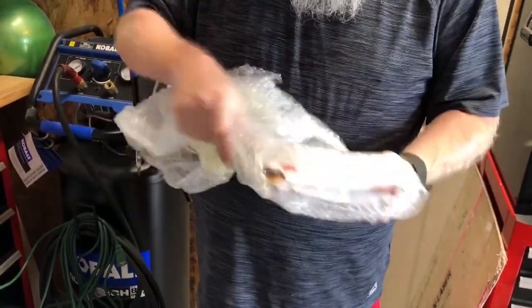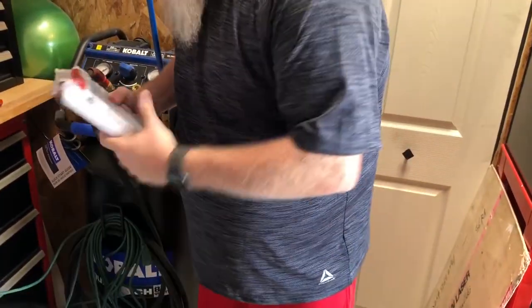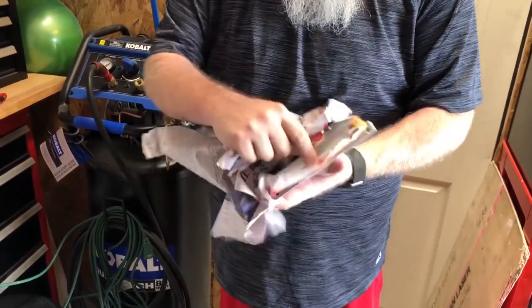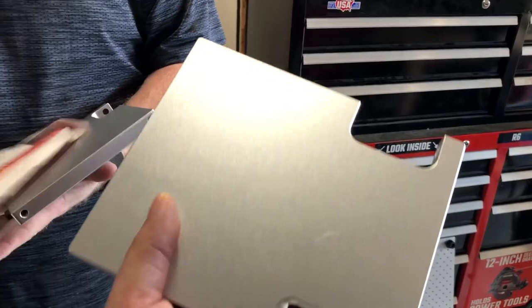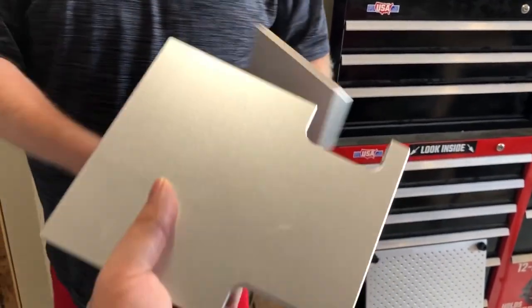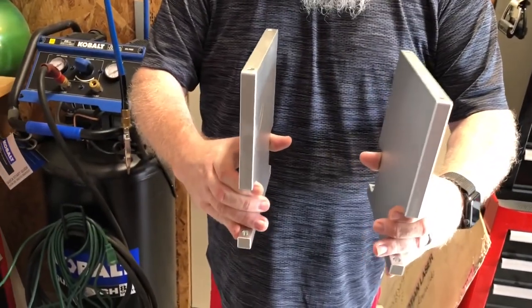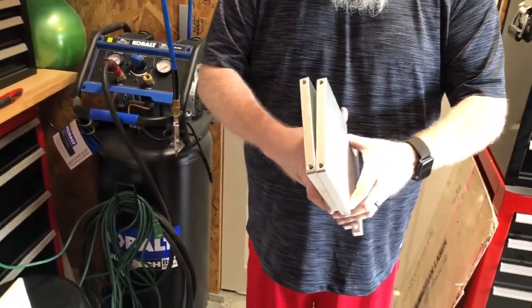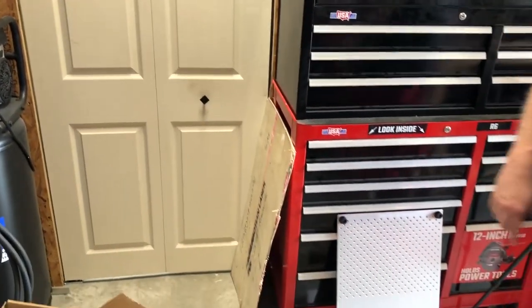It's the thing to lift the laser off the board - it's a chunk of aluminum. If you want to do a 300mm lens instead of buying a whole new gantry to set the laser on top of, you put this here and connect the laser to it - it's a tower that goes up and down for your focus. Those things weigh about eight to ten pounds each, or as another maker would say, about an adult cat.